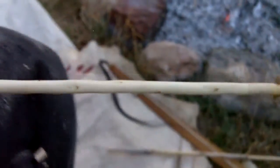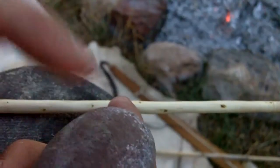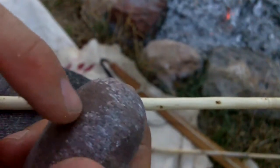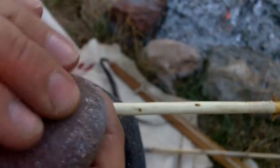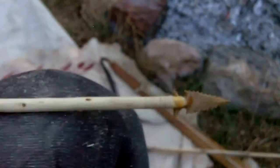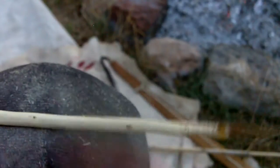The wood can be made smooth by just burnishing it with an antler — just rub it with an antler, and that's what I did on this. Sanded a little bit with a rough stone like sandstone. Just don't do it too hard and create too much heat, because the heat will cause the wood to stick in the little crevices and it won't be able to sand. So just lightly sand it — it takes a lot longer than sandpaper. Make sure it's dry, because green wood will load this up and it won't be very useful for sanding. After you sand it, just burnish it down with the antler.